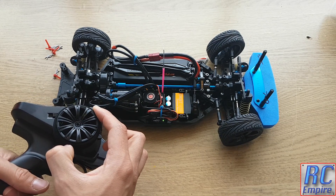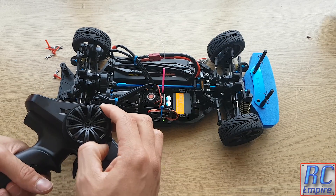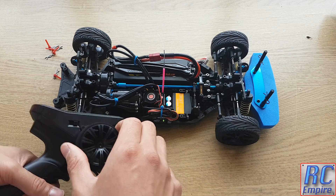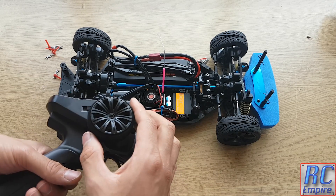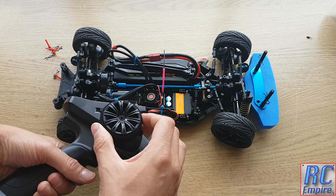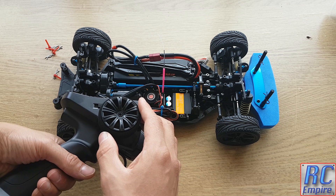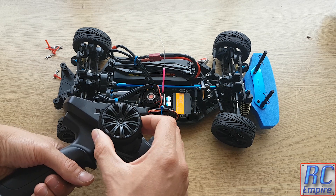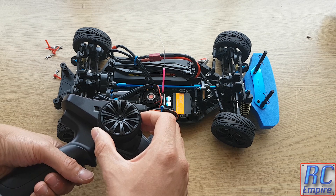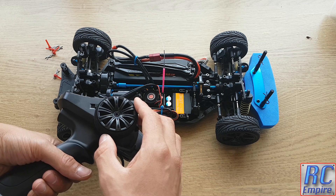You can see a little bit of movement there as it tracks every input I make - it moves as fast as I can. Slowing it down to almost frame by frame, you can see there is a tiny bit of lag, but really this is at 5% speed. This servo is almost as quick as it gets - the fastest ones out there are around 0.06 seconds and this is 0.07 seconds. From what I have read, the fact that it's coreless reduces that lag time from input to movement.